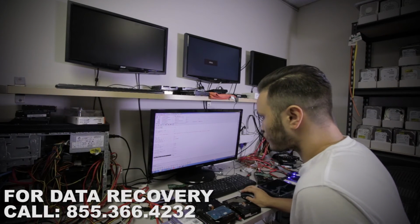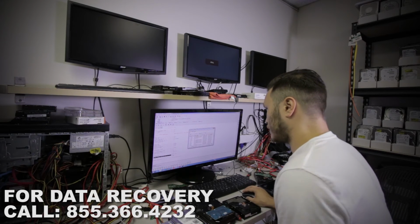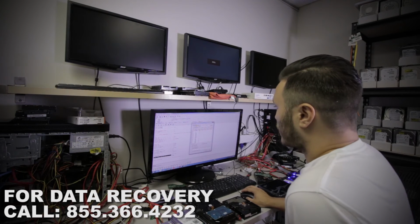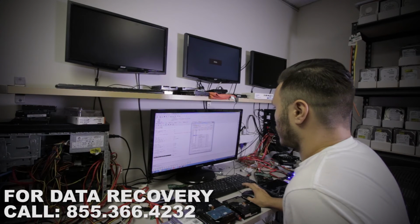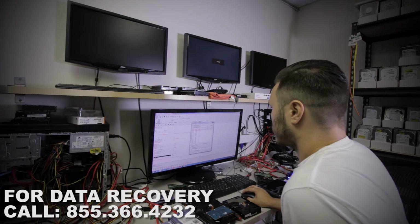Okay, so now I'm going to go to service area, and I'm going to read all of the modules. I'm going to create this profile as I did before, rebuild, ROM rebuild for YouTube. Up here, all of the modules that begin with 100, first of all, I'm going to deselect everything, and I'm only going to select modules that begin with 100. So 102, 3, 4, 5, 7, 8, 9, 10, whatever. And reading by ID.